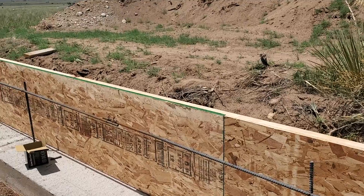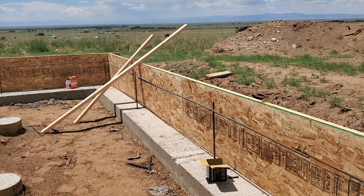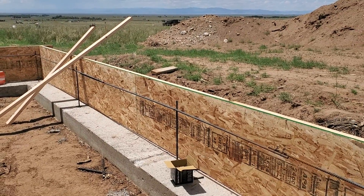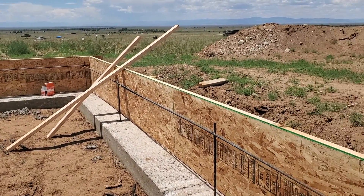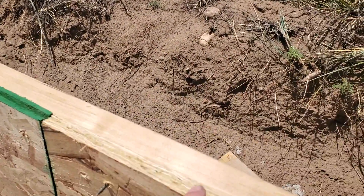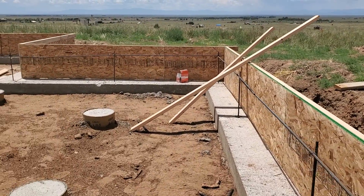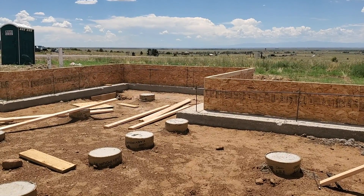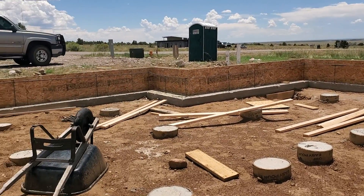This is three-quarter-inch OSB. Should you use OSB for concrete forms? Probably not. But can you? Yeah, you can definitely use OSB for forms. We probably won't be able to reuse it for flooring or anything like that, because the water can get into the strands and it'll expand. But just for what we're using it for, it'll be just fine — we'll get the inside form up, fill it with concrete in a couple days, take the wood off the outside, and it's going to be perfect. The outside will be covered with dirt and you'll never even know.